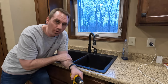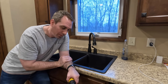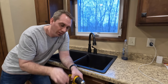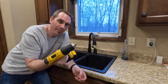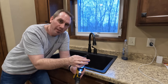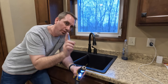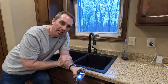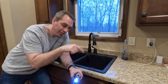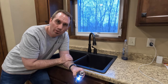But like me and most of you, I don't have a big assortment of hole saws to draw from. Of course we could go buy a specific one, but I don't want to wait — I want to get this done tonight and I don't want to run to the store. So what we're going to use is a 5/32" regular drill bit in our drill. This fits in that knockout channel perfectly, and I'm going to drill a series of holes around that knockout to weaken it further. Then we can tap it out and smooth it up with a stone or carbide bit. Let's get to it.